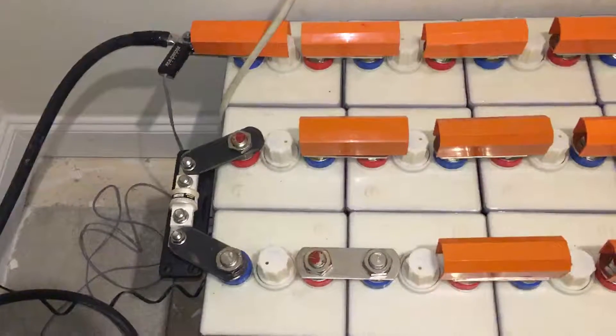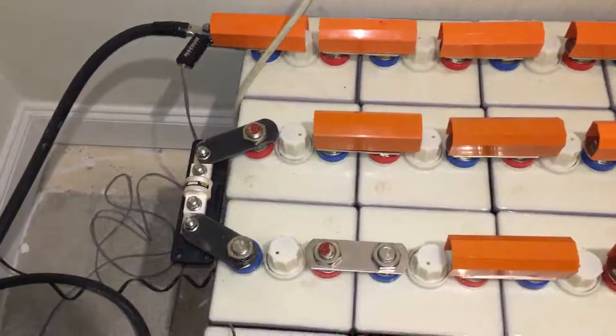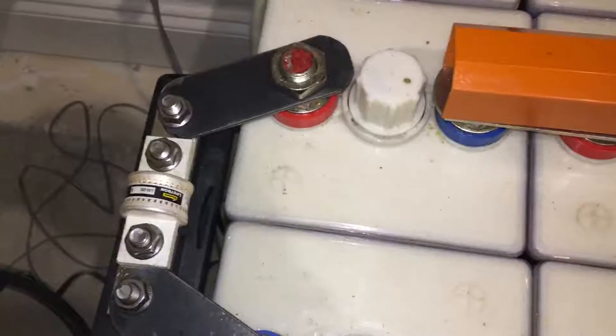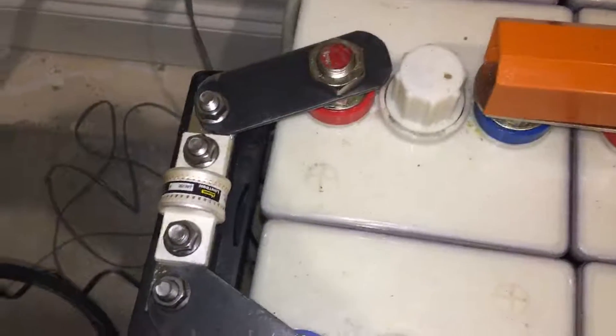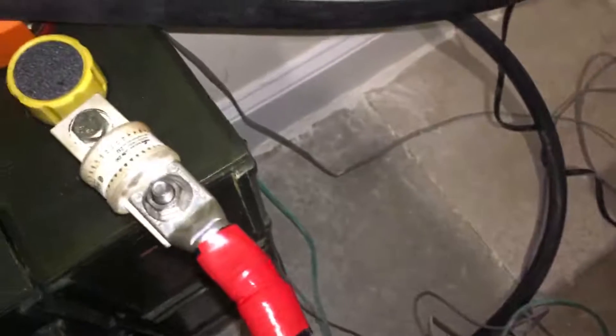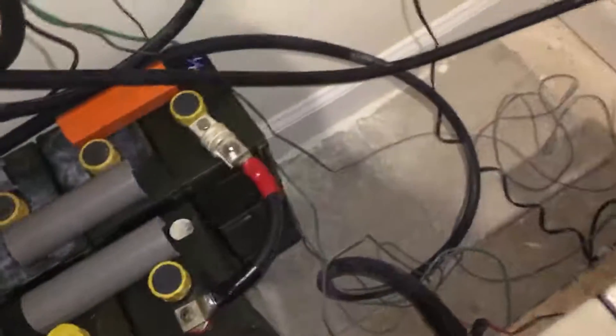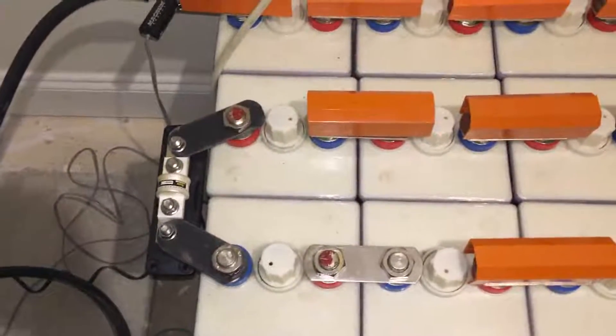From a safety perspective, I'm not going to take any chances with my family and my home. So I went out and bought it, and this is how I have it mounted. You can see the fuse right there. It's in series, so if it blows the entire battery bank circuit is broken. I also have a second fuse here — if that one blows, the circuit is broken and the battery bank is essentially dead, protecting your investment and your home.